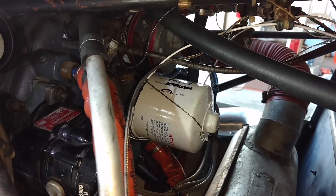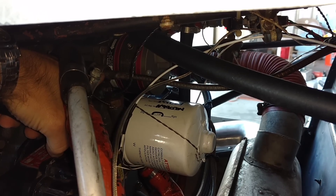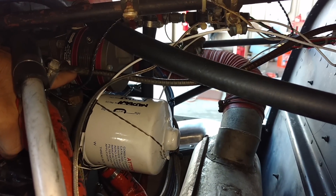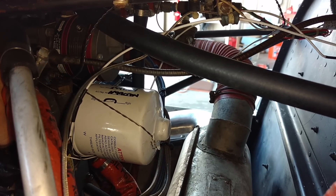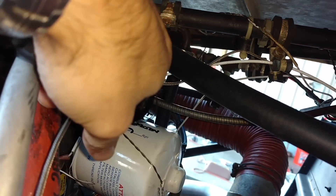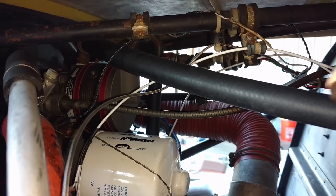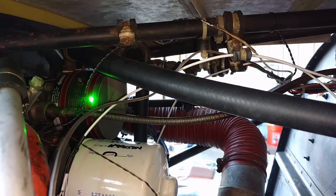From this side of the cowling we can see this one wire here — that little wire is connected directly to the crankshaft and measures engine RPM. There's a little wire inside that casing that spins around and goes to our tachometer. So there's just a little metal wire spinning around in there, and that is what feeds our tachometer — as soon as that propeller turns it'll start registering. And then this little thing with the red bands around it, which looks like a pump of some sort — if we follow those rubber tubes coming off of it, one rubber tube comes off back into the cockpit — that is our vacuum pump. Basically the air is being expelled overboard while low-pressure suction is being pulled through this tube. That little guy back in there is our vacuum pump.